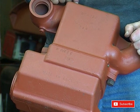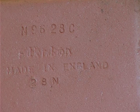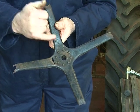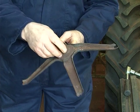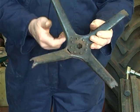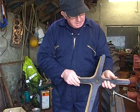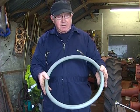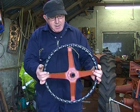This is the air cleaner — the numbers you see tell the day and month that this part was cast. One part of the tractor almost completely rotted away was the steering wheel. The cost of a new one was £150 plus VAT plus carriage, so Raymond decided to make one. The centre part was still in fair condition and could be used again. Raymond had cut the outline of the old one out of cardboard and used this as his template. The rim was bought new quite cheaply, made out of 3mm steel — you can now see the final product, a brand new steering wheel.